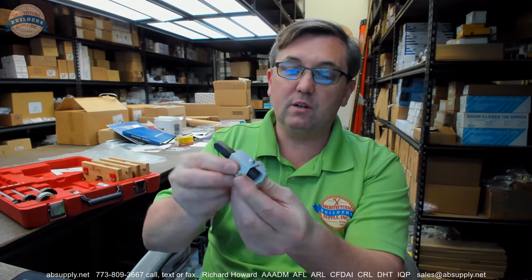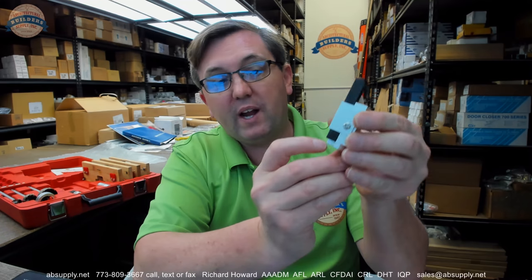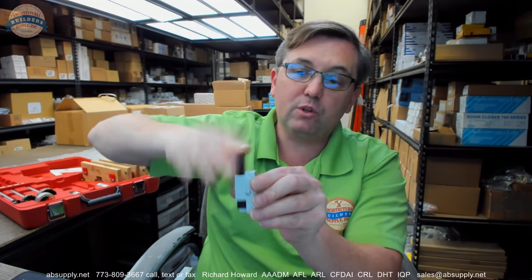One really cool thing about this kit is you get a corner chisel. You are going to route with your half-inch router, and we will talk about that in a moment. There's a very important feature to the requirement of the diameter of the router bit and the outside diameter of the collet. You're going to square that off into the corner of your prep right here. You'll square it there, and you'll give that a couple of good little smacks with your hammer. It'll square out the corner. You might need to clean it a little bit, lift some material out, but otherwise it's perfect.